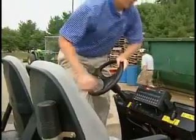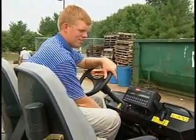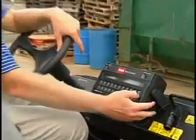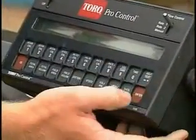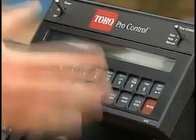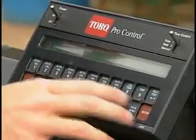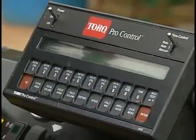In order to get these sprayers to run with these computers while it's not moving, you have to put the computer in self test. To do that, you press self test, enter. Find out the speed the operator typically sprays at. For this situation, we're going 3.5. Press 3.5, enter. And now your boom should operate.